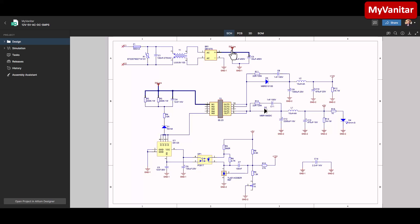This line comes through this RCD snubber circuit to dampen the spikes and noise of the primary winding of the transformer. The purpose is to protect the internal MOSFET of this controller chip — sometimes the MOSFET is outside, sometimes embedded inside the controller — but the main reason is to protect the MOSFET, and also for EMI.